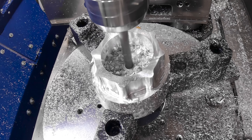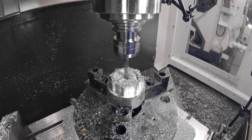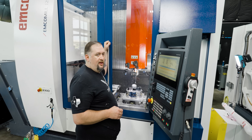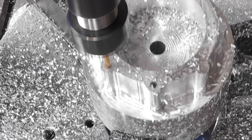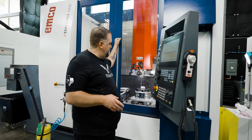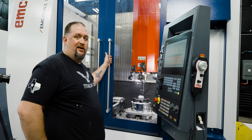We're taking this drill all the way through our part to give us a hole we can probe for our second operation — assuming we don't completely incinerate our part. Here we're going in with another drill, so again we're in a risky operation where we're creating a lot of friction that could potentially heat up these chips so much that they spontaneously ignite. For those of you not familiar with magnesium, it burns at thousands of degrees Celsius, which means if our part actually ignites it's going to be hot enough to burn directly through our chuck, through our pallet system, and through our machine table. I will be quite pleased if I don't burn this machine to the ground on the first part I run on it.